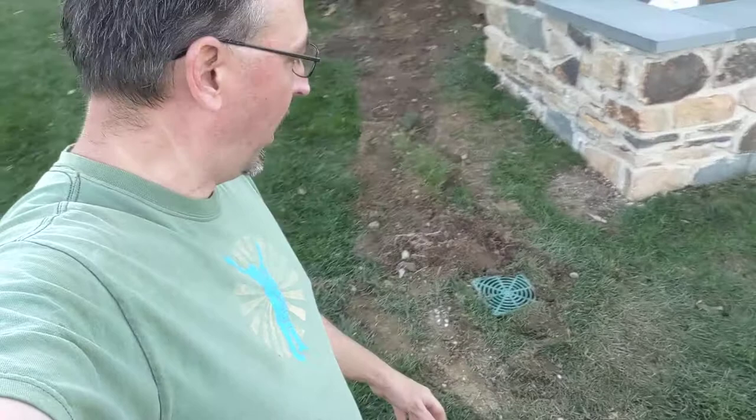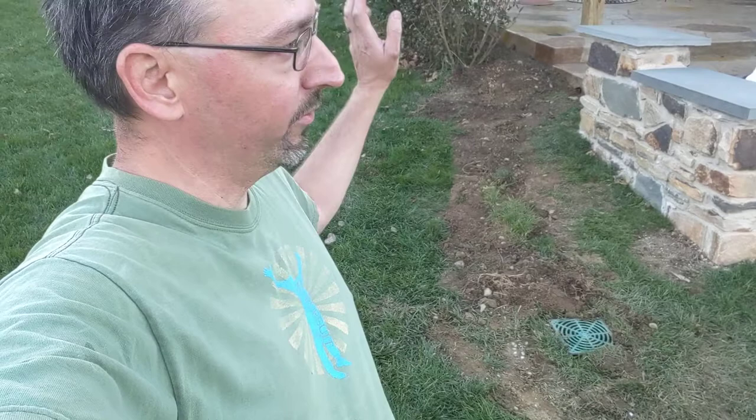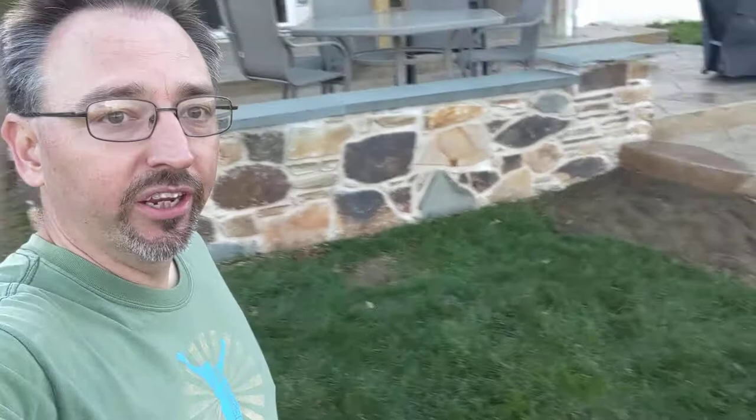That's one of the ways I really like to do this. I don't like pop-up drains because I don't have a way to ensure they don't freeze in the wintertime. With this system and being able to put those drain holes in the bottom, there's a pretty good chance we're not going to have a problem with water freezing in there — if it's melting, it's warm enough to come in and it's warm enough to perk and go down. And with five drain holes, if one gets clogged up we have some other options.